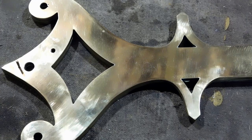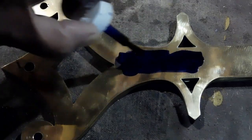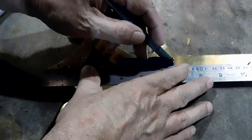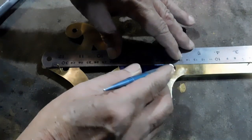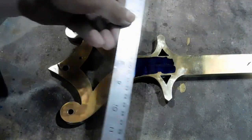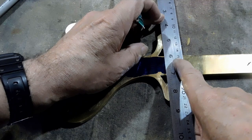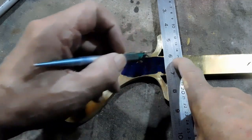There are our two plates, pinned. Now we're marking some layout dye and we're going to mark the position of the center wheel. Normally when you're planting the wheels you plant the center wheel first, but I'm getting the center line on either side of the pins so there'll be actually two center lines. You can see the two tangs coming out that hold the dial on the clock — the center of the center wheel is in the center of the dial. Because the great wheel has such a big pivot and the hole is so big, I decided to drill that one first and then work up to the center wheel from there.